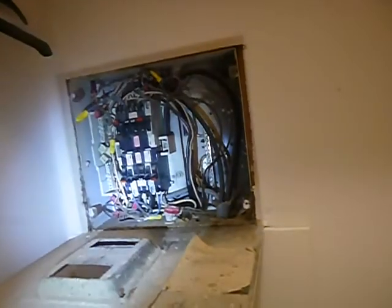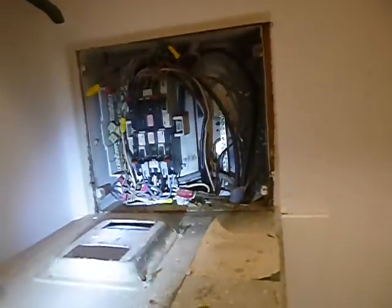Just look at the electrical. Come in the electric service panel. Talk to him about the Federal Pacific. Know what your options are. And just address the panel, move the grounds over, a little bit of labeling.